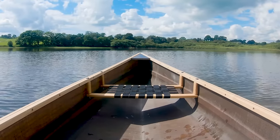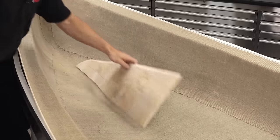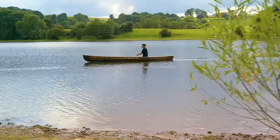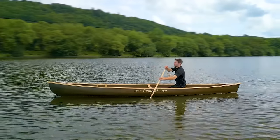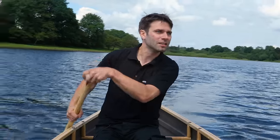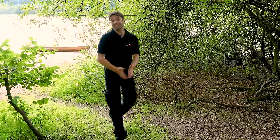Hi, Paul here from Easy Composites. Today we've got something a bit different as I take you through the process of making a flax fibre canoe using resin infusion, in a method that combines advanced composite engineering with natural materials. From laying the flax fabric and balsa cores to infusing with bioresin, I'll be demonstrating the entire process to produce a canoe that rivals the weight and performance of a fibreglass one but with a reduced environmental impact. Whilst flax might not suit every application due to its limited mechanical performance, it certainly makes for a compelling option in scenarios like this, proving that sustainable choices can produce both viable and beautiful results. Whether you're a seasoned composites engineer or just curious about sustainable materials, welcome along and let's get into the workshop.